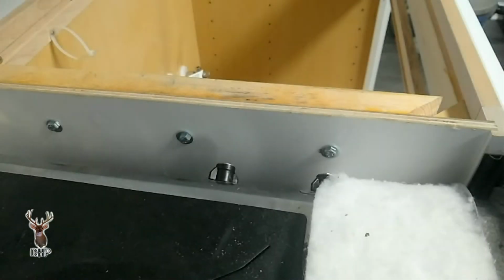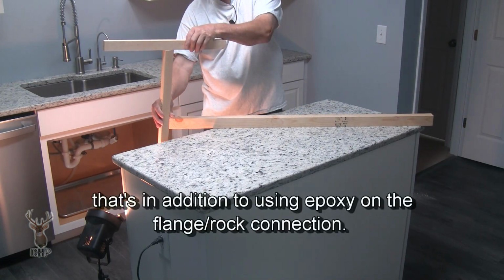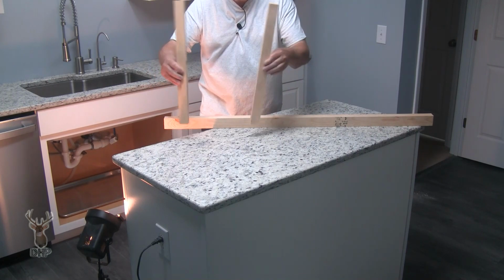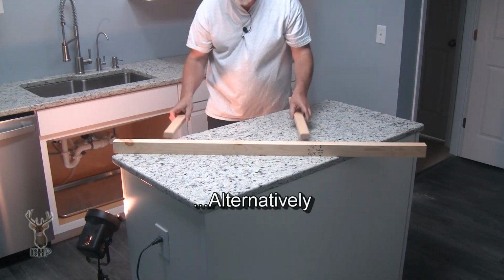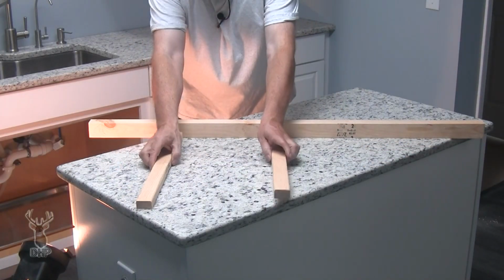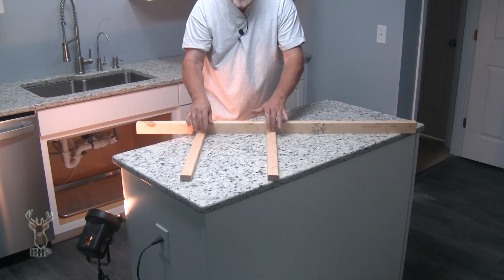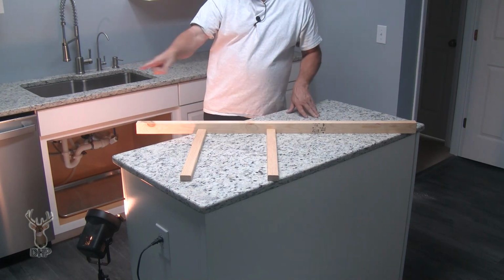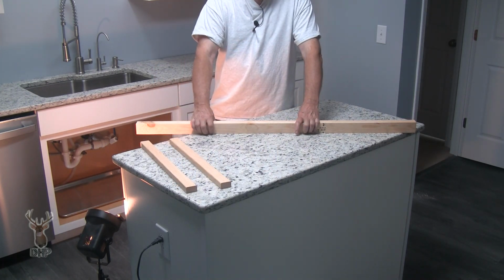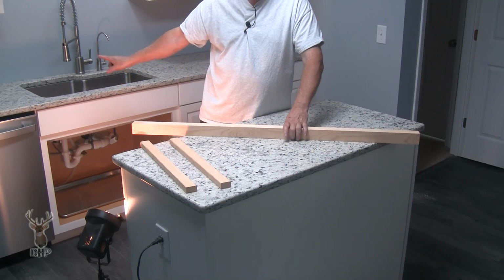where the plan was, as explained to me, they were just going to put this old gray piece of scrap 2x4, run that up against the bottom lip of the sink to hold it in place, run a vertical piece, run some screws to it. Now, true, we could have put a cross member like this and up underneath it, taken our braces and gone up under it. Or if you prefer from the bottom side, sink would go on this side. This would go right up against the bottom of it as the ledger, and then we would post it from below in each side, again running screws into and toward that dishwasher. I didn't want to do that. You saw the ledgers. But when I went to put the sink in, it wouldn't fit, even though there is plenty of room for those flipping clips to clip the flipping sink.